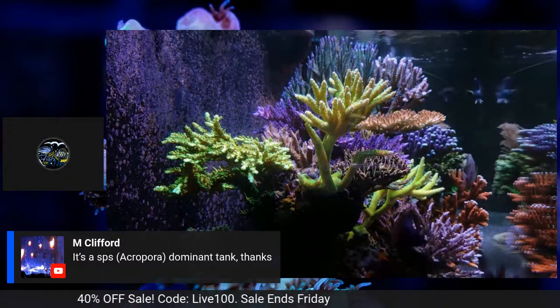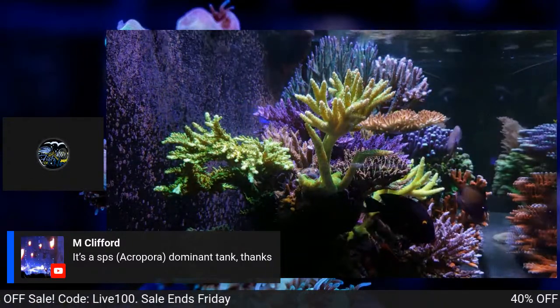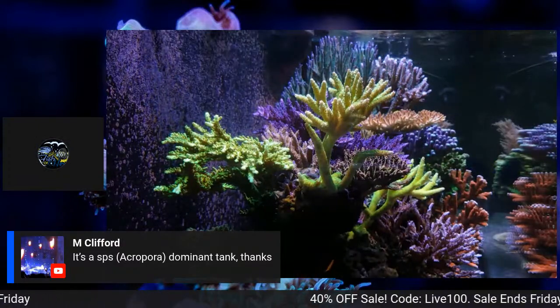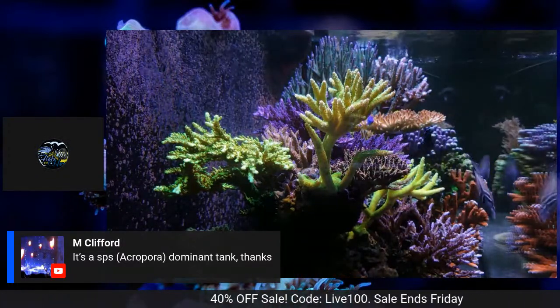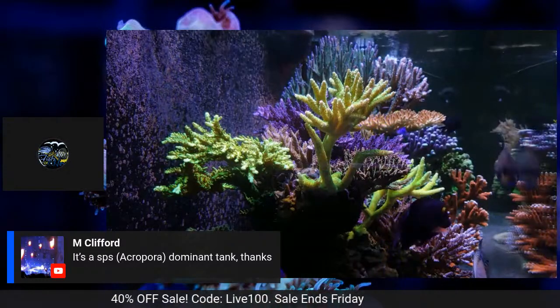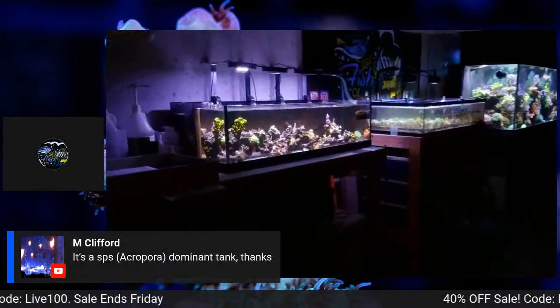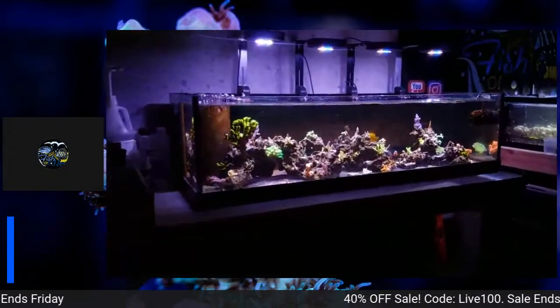Say your heater kicks on at 78.5. Have the chiller kick off at 78.7. Just have the chiller kick off at that point, because by the time all that water gets circulated through the tank and back to the heater or the temperature probes, it would already be off, so you're not fighting it eventually. So yeah, there you go.